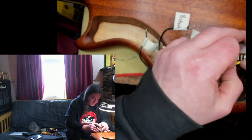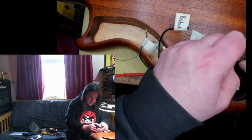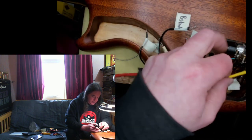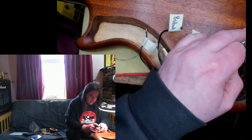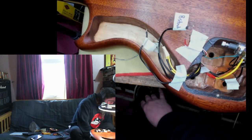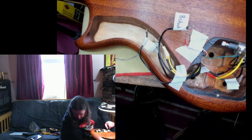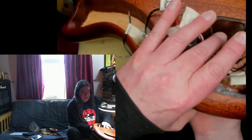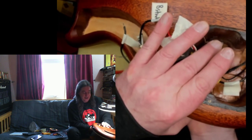So that's the tap wire — I'm going to put it to the switch. When the button's up it taps, when it's down you don't want it to tap. So you don't want this connected to earth when it's down. I'm not putting fresh solder onto the terminals on the switches because I'm reusing the old switches — they already had solder on them. I can't believe how much simpler this is looking already — that's half the guitar wired. I've still got earth wires to do but I'll do those neatly.